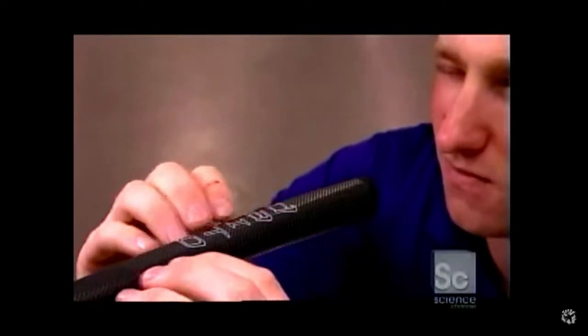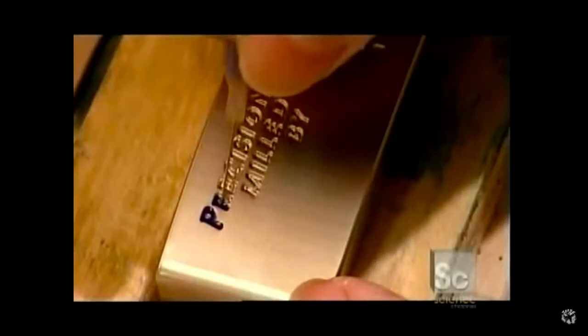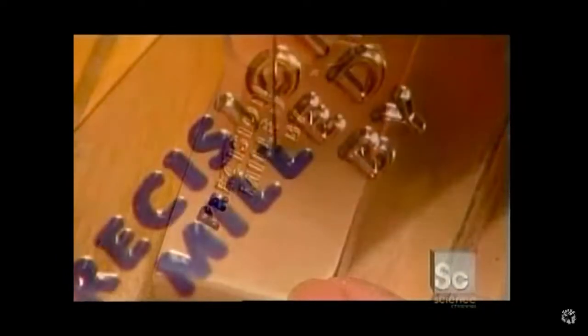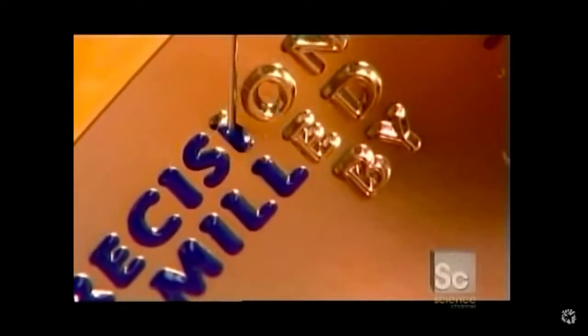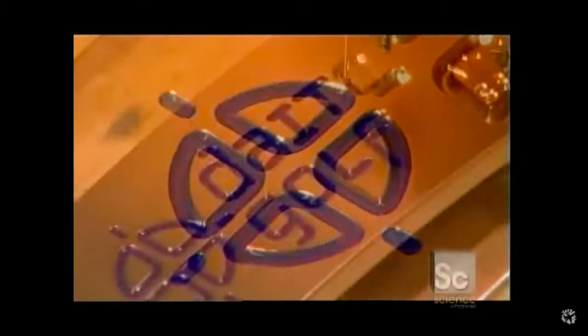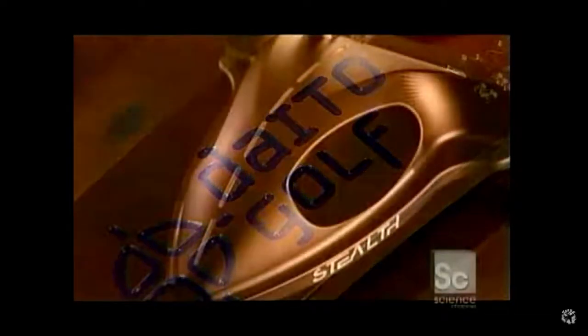And he lines up the flat part with a 90-degree angle at the head to help strike the club properly. And then a worker colors in the logo using epoxy paint inside of the grooves of the design, and controls the amount of paint with a foot pedal, which releases air to let the nozzle go.